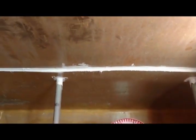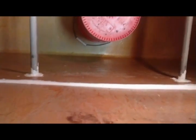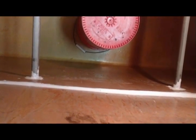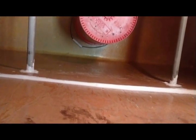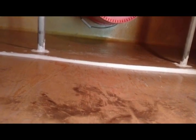We used about two and a half of the three tubes of Rubex and sealed the seam all the way around, filling deep within the crack as much as possible. Also, where the steel reinforcement rods were, we went and sealed around those. Before applying sealant, I had run compressed air through the crack to remove debris, then another round of rubbing alcohol to make sure there was no oil or anything else in there. There were some spots in the seams that were maybe a half inch wide, but they tapered down, and we just kept working the sealant in, getting as deep as possible into the crack, then did a quick smooth over to make it easier when rolling the liquid rubber.